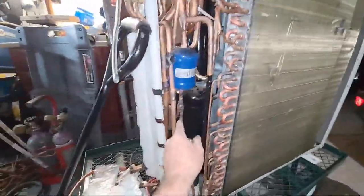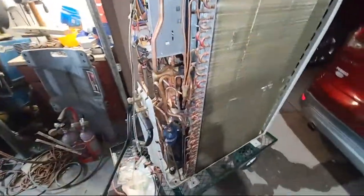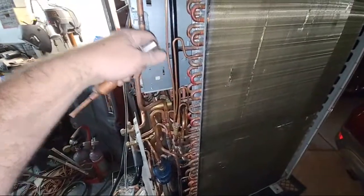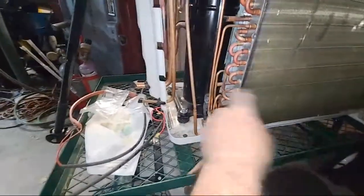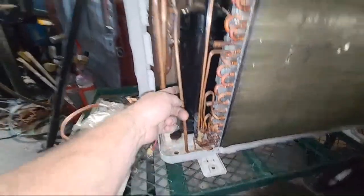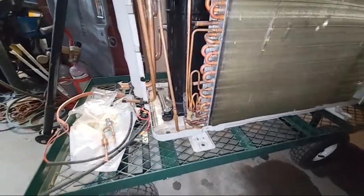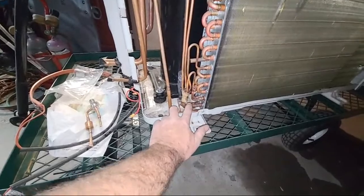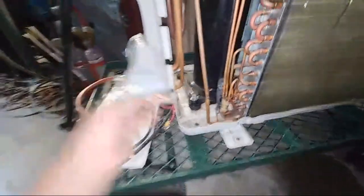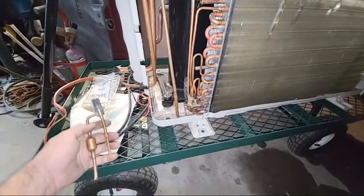The way this one works is a little tricky — remember I had to do the reversing valve, expansion valve, check valve, reverse all that stuff on the Lennox unit, which works great. It worked for two winters now without a defrost control, never froze up. This unit has two coil halves that were joined together. I just put in the filter dryer — you'll never see that on VRFs, but this isn't a VRF anymore. It kept a splitter with the two coils joined together and two common gas lines joined from factory.